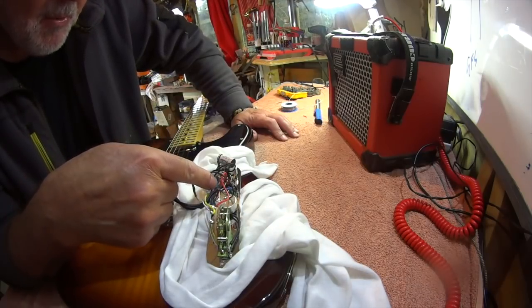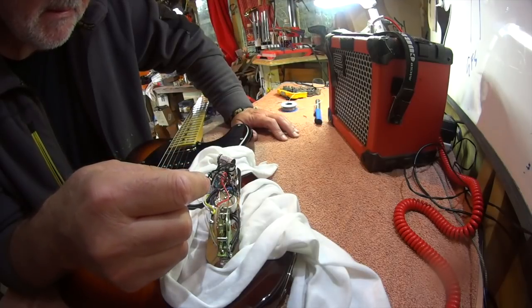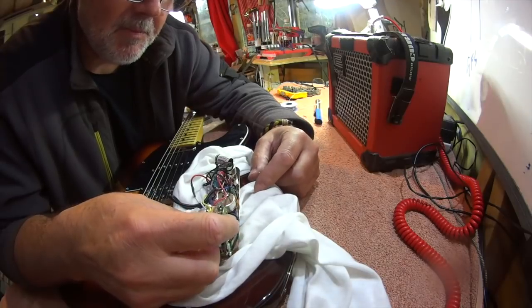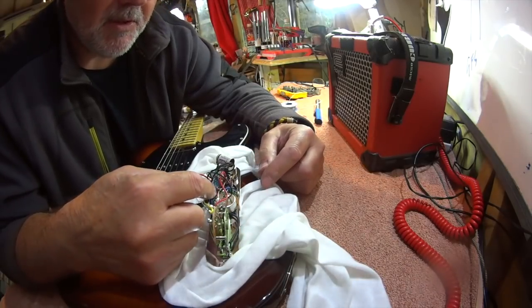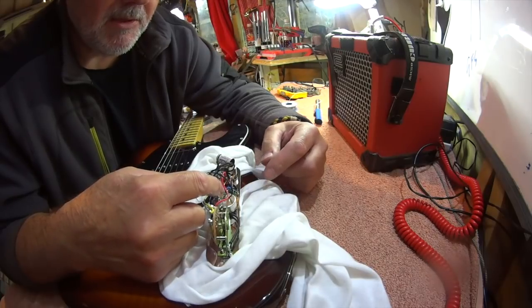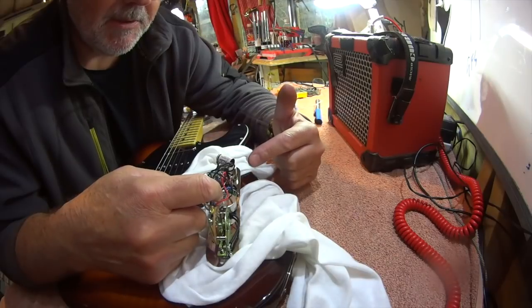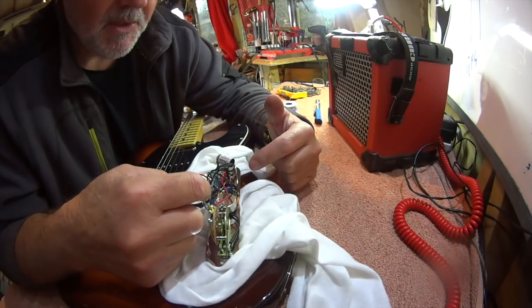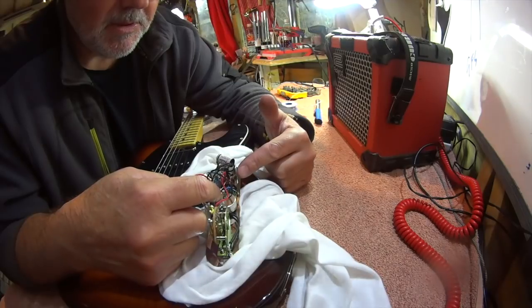maybe this switch doesn't permit us to do this. That's really an absolute pig's ear, that is. Let's think it through. What are the alternatives? That white is the coil tap, which goes in here to the middle, which makes it work. I don't know fully what's happening inside of that switch. Switching those out, one becomes the plus.